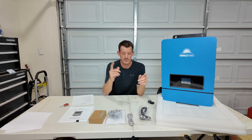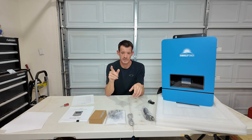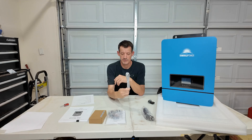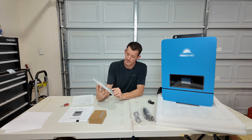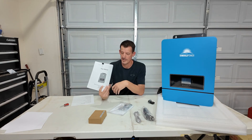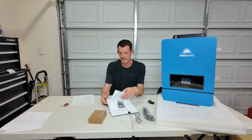It goes from one unit to the other so that you can start pairing them up to jump to 20,000 watts. If you've got two, you can add all the way up to six units getting 60,000 watts. These cables are just communication cables that go between them so they all know what the other one is doing. It also came with what looks like a Cat5 cable — probably for battery communication — along with an instruction manual, the main lugs, a couple of little sleeves for the input wires, a little wrench, and the nuts. I also downloaded the user manual online and printed it out — it's got a ton of information along with all the different wiring diagrams.